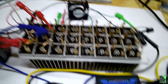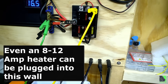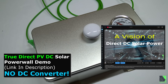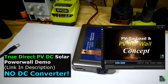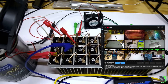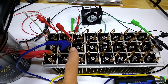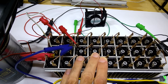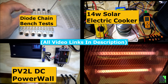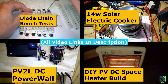I'm trying to save some power for other appliances, because it all comes through this Powerwall. Here's the cable powering that heater, and I have other things on here — you can see from the fuse block. I'm able to run any kind of appliances I want and plug them into outlets in the wall here — they're directly solar-powered appliances. If you're interested in learning more about this Powerwall and running direct solar-powered appliances from solar with no battery, no DC converter, just straight solar power straight from the panels, I'll link that video down in the description. Eventually, these fans will be integrated into the heater — however, they're powered by the diode chain itself. That fan and that fan are being supplied by a lower DC voltage that is tapped off of this diode chain. The regulation is not perfect so one has to be careful, but I've been powering fans for a very long time using this method and it works well. If you want to learn more about diode chain technology, check out my other videos on the topic where I explain it in detail. I even use solar-powered diodes to cook food successfully. Development work on larger, solid-state solar electric heating systems is ongoing, and I hope to post further updates when possible.